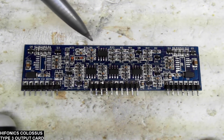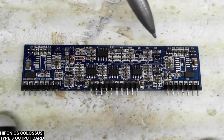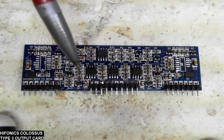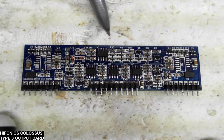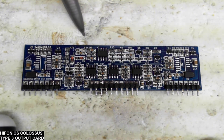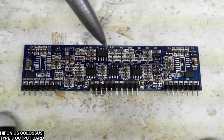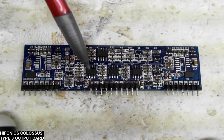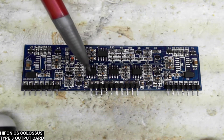The first thing I want to point out — I think where they're getting that 'dual mono' from — is from this setup right here in the middle. For techs that are familiar with the type 3 boards, you'll see that they typically have a single 072 in line with a 211 or 311. Well on this card here, you'll see that we have a 072 in the middle and we have a 211 on each side of that 072.